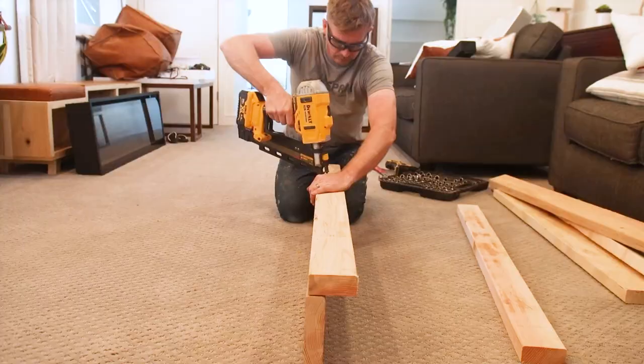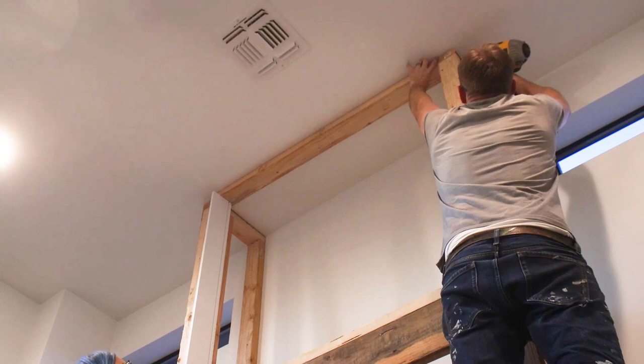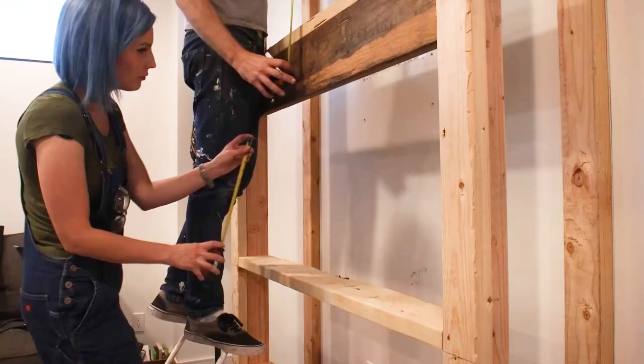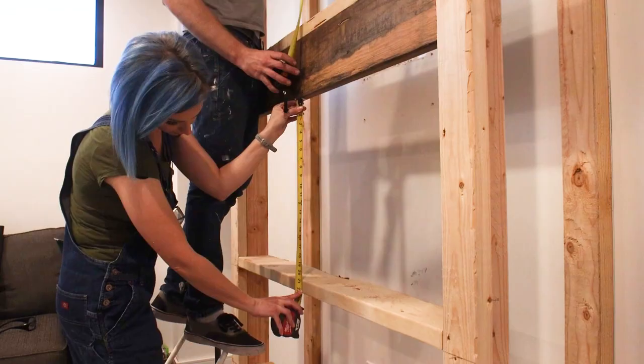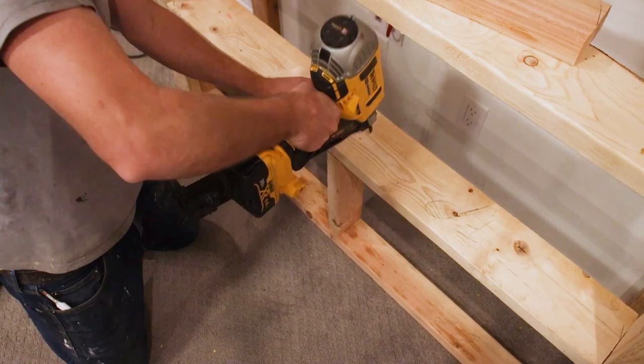To create backing so we could mount a flat screen TV, we nailed together another 2x4 and a 2x8 in that same California corner fashion. We then finished tying the walls together using a top plate toenailed into the lateral walls. Toenailing is when you secure two boards together by driving a nail at a diagonal angle, but I've included a slightly easier modified design in the building plans. We verified the height of our horizontal supports, making sure they were level, and then began adding our vertical blocking.